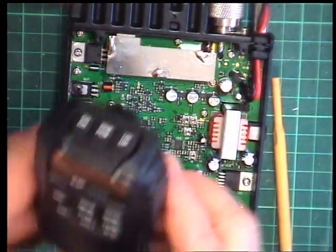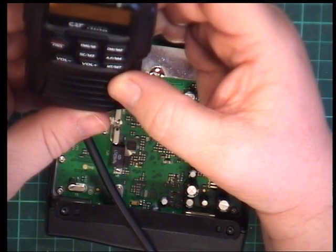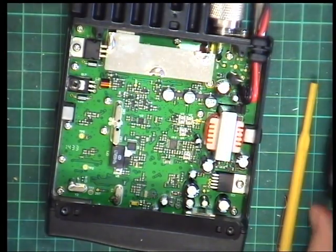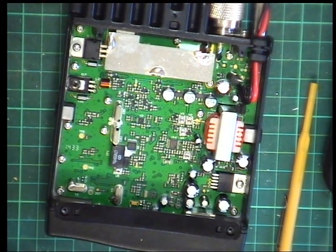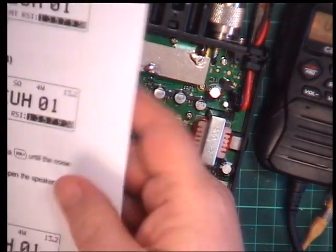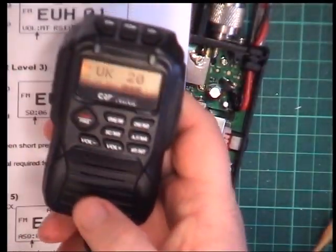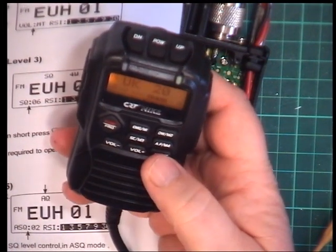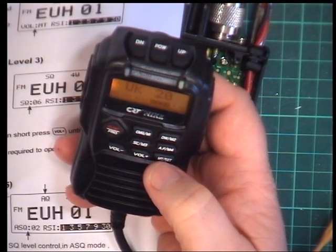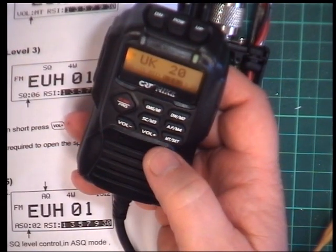So I wonder if there's an auto squelch which those presets do. So I'll look up the translation to just see if there's some more features. So yes, there is an auto squelch. There's also a mute function. So if you're in the middle of something, you can press MT. We're in keyboard lock at the moment. So MT, instant mute.